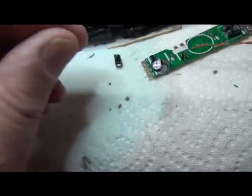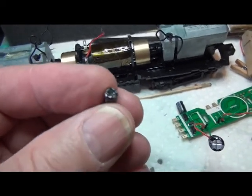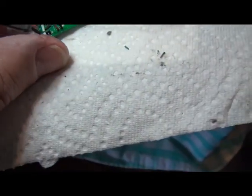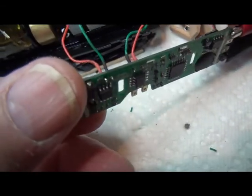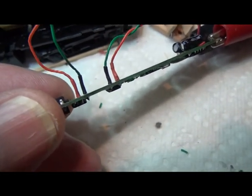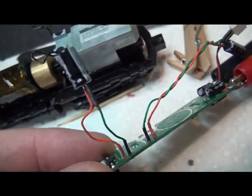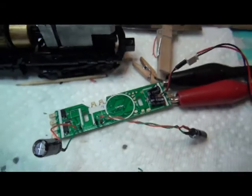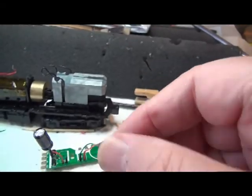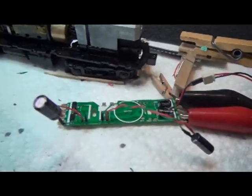I carefully cut the wires off right up close in there. I soldered new wires — I had to buy some because I don't want to get close to the board itself or desolder from the board. Those are the original solder joints right there. I then very carefully attach wires and connect those wires to the right-size capacitors. I'll have to test it to make sure I haven't messed anything up.